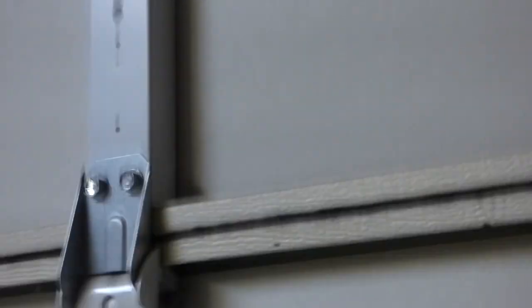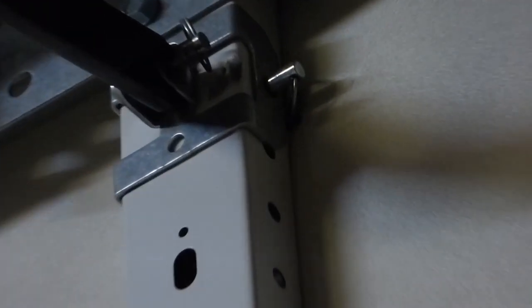First step is to get down your old garage door opener. Come along here — most of them have this tension puller. You pull that down, which this one's already been released. What that means is once that's released, you can open and close the door without the use of that. Next thing I will do is take apart this little pin assembly here. That there connects the arm to the door, and all this one here is a little wire — it could be a cotter pin here.